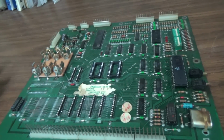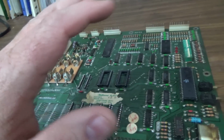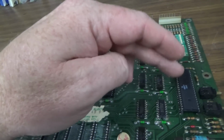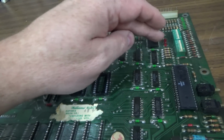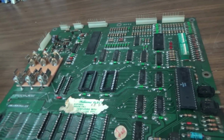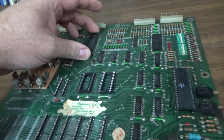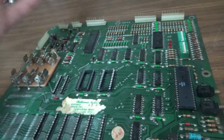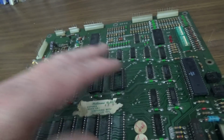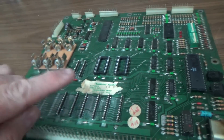So I was like, man, something failed. So I kept messing around. And I get so deep down the rabbit hole whenever it was much simpler than I thought, right? So I'm looking all over the place, and I kept thinking that it was working and that it was running the code, but that it wasn't flashing these LEDs right. So I took the RAM chips out. Okay, maybe a bad RAM's messing it up. Nope. I swapped the PIA because it wasn't socketed, or the socket was bad, whatever. Like I said, I've been working on it for 2 weeks, so I can't remember, but I swapped the socket. Then I swapped the socket on the CPU just to make sure, because they were Scan-B sockets too. Those are crappy sockets like we talked about, maybe in the previous video.